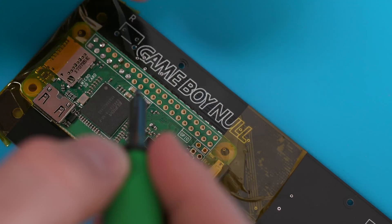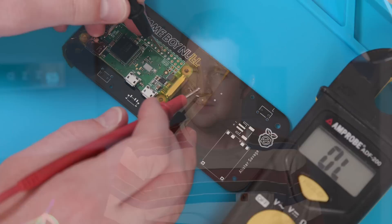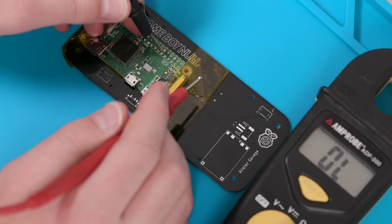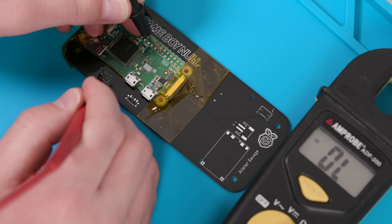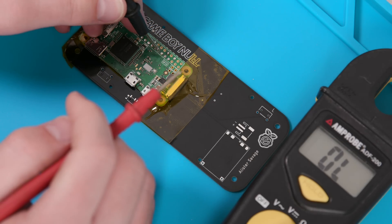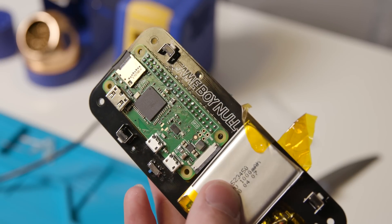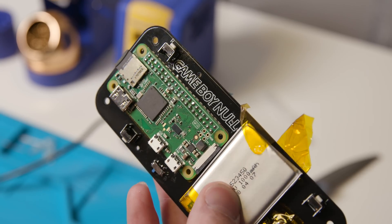The documentation shows you which pins to solder — theoretically you don't need to solder all of them. But when I got my multimeter out, I noticed that a couple of pins didn't seem to be in the right place according to the diagram. If you don't have a multimeter, or you just want to avoid the headache, you can just solder every single pin. You won't do any harm — in fact, there are a lot of upsides, like the board being more stable. The only downside is that it takes a couple more minutes.